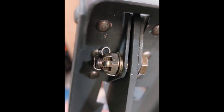And this is one that's real key, where I grab that long tip, the longer leg of the cotter pin, and I really pull on it as I spin that around, and then I make sure that leg bends over the top of that bolt, or the end of that bolt, nice and flat so that it can't twist to either side. And then take that shorter leg and just push it next to the bolt, nice and tight. That way, when you put a finger on it, you shouldn't be able to rotate that cotter pin back and forth. It should basically be solid feeling, almost like there's no play in it. That's another thing that just takes practice.